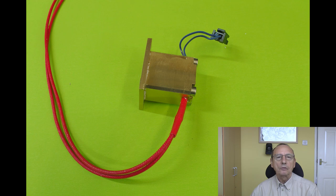So basically the heater and thermistor cartridges go into vertical holes in the big hot block, and then the nozzle block has slots to take the wires so they come out the side. There are no clamps or screws or anything that hold those cartridges in. To change it, just undo the four bolts, drop the nozzle block off the bottom and slide them out.